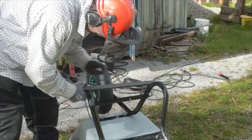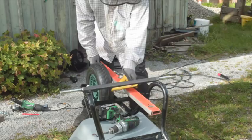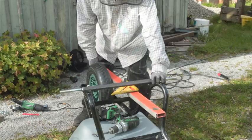Put the bolt in one side tight enough that it just holds it, then you can fine-tune the other side. I eyeball it up to the strut on the wheelbarrow, but bear in mind the frame of the wheelbarrow isn't going to be totally square. Really the axle wants to be square to the front wheel — so you eyeball it, compromise, and drill again.